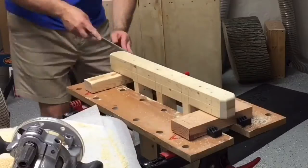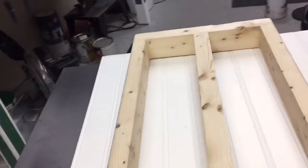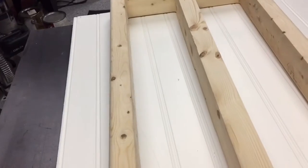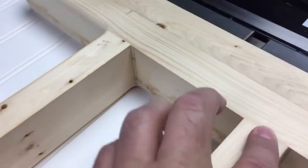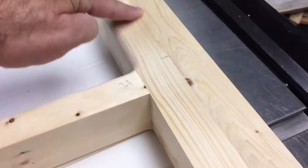I have a piece of leftover bead board that I'm going to put on one side of the leg frames to give it some stability. I'm simply going to glue it to the wood, but I needed to make sure that my joints were absolutely flush, so I took a few moments with my hand plane to make sure everything was very smooth and also planed down where the two boards meet.